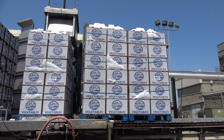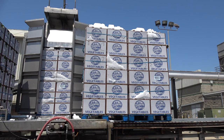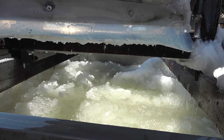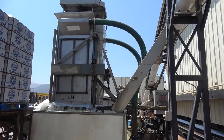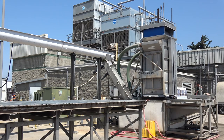A pallet being re-iced is checked because it may have had too many holes on the side where it didn't fill up properly — the operator can tell just by looking at the side. A stainless steel tank holds the 50-50 mix of water and ice, and a large paddle continuously rotates to keep the ice suspended. Ice is made on site and augured to the icers. All components of the jacket icer are made of stainless steel to prevent rust from contaminating produce and to improve food safety, as many microbes do not grow well on stainless steel surfaces. TNA has a dedicated jacket icer for organic produce to comply with regulations and prevent cross-contamination.